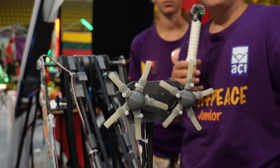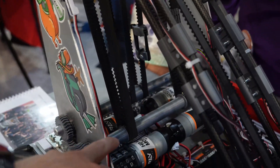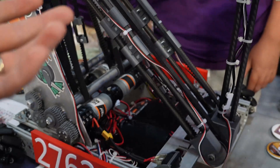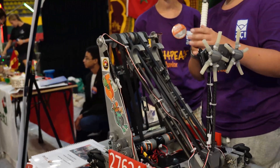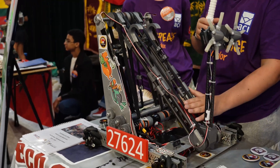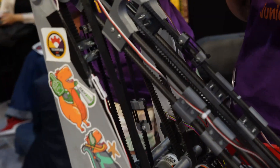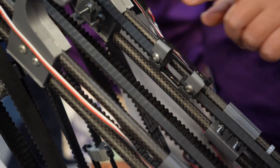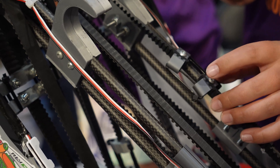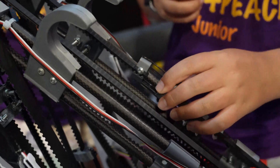You've got quite a few belts here working on a large pivoting system. Tell me about the pivoting arm — why you went with such long belts. The arm length required long belts — it wasn't optional. We made custom belt tensioners using VEX parts with zip ties that pull the belt in really well.